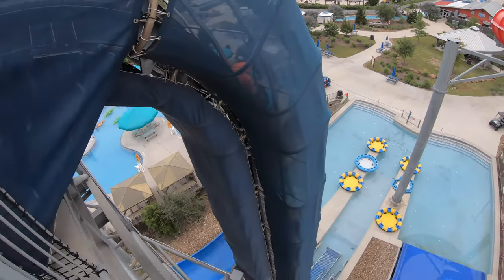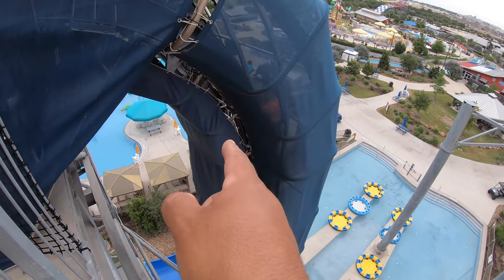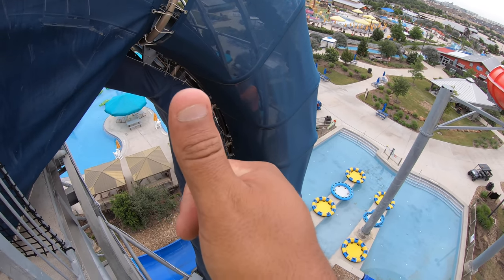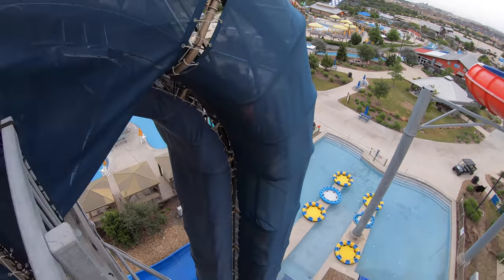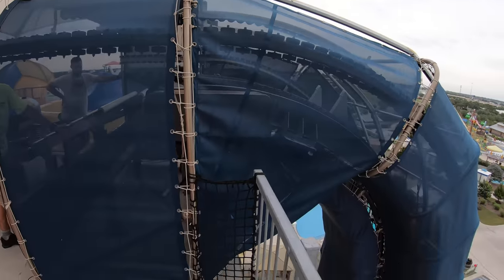What he's doing now is he's going down the tower. There's a cleat right there. He's gonna tie off a chain fall to the next cleat. That's gonna reduce the pressure off this chain all the way down. We don't wanna have to go chasing it. It's a lot of work if we have to do that. So he's just tying it off, ensuring that it's not going to fall on us when we disconnect up here.